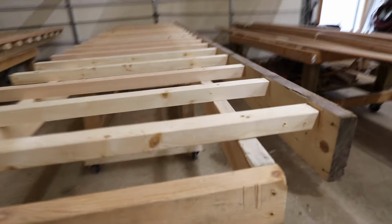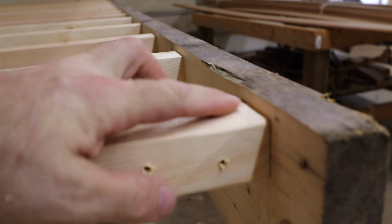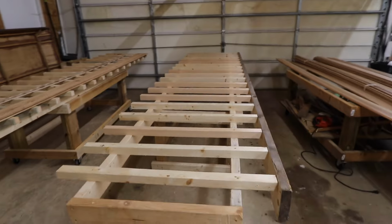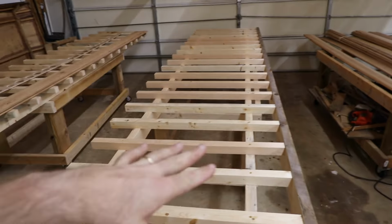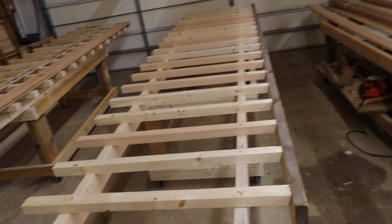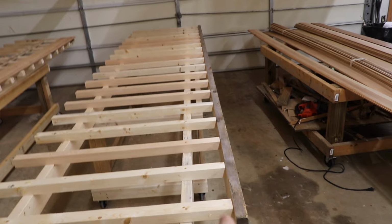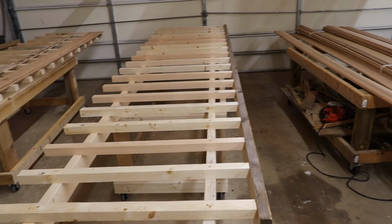All right. We have our board running all the way down. We raised it up just 1/4 of an inch because that's how big our panels for our decking will be. The reason for this is we need to build the top and bottom decking. We're going to build a jig to do this glue up. We're just going to use some scrap wood for it, and I'll show you as we go. But we need one edge to be super straight. That's the reason we did this, because we're going to be clamping everything against that fence here.